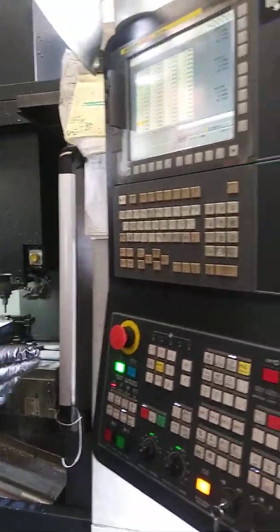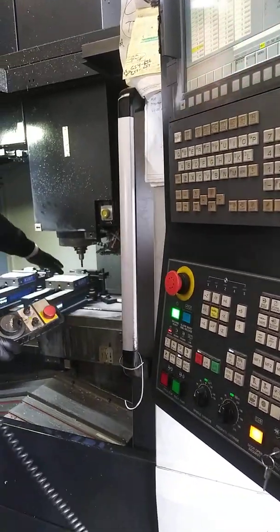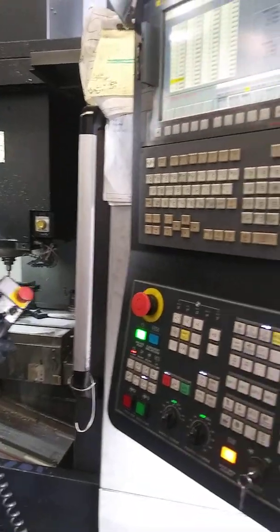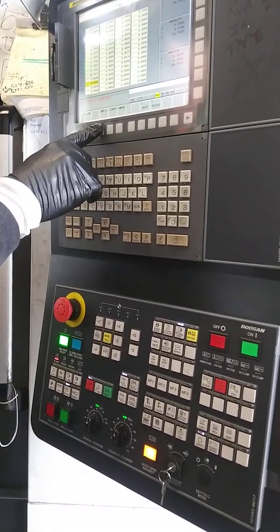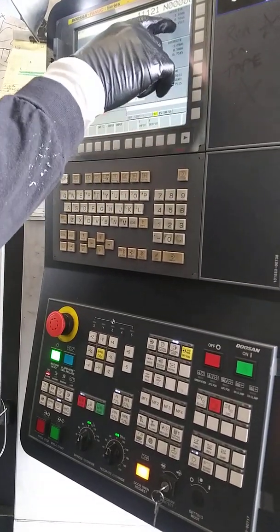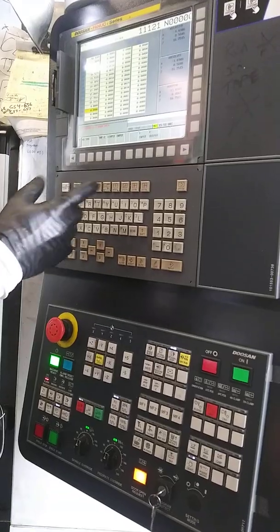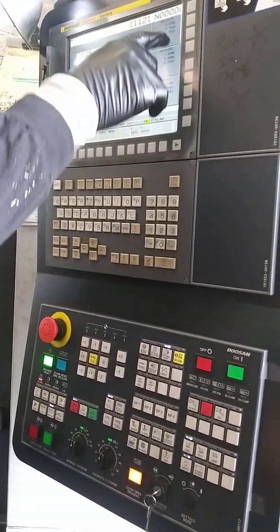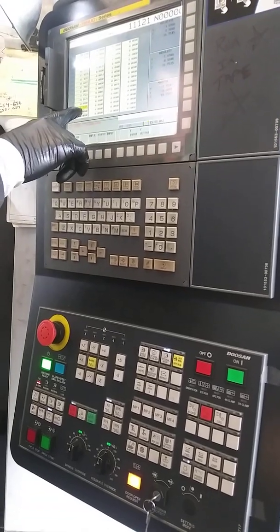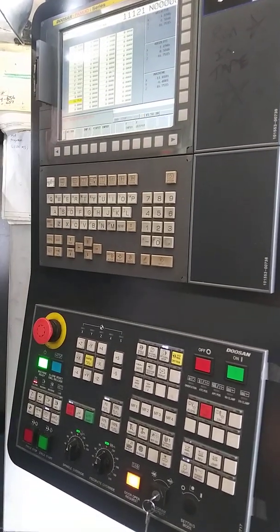Now I want to touch this tool on. This is my T10 or T9 - this is what we're going to touch off after T3 ran, which means it's a flat surface. Now I push Z, input calculate. That number, that number, that number - are all the same numbers right now. So that number is going to go right there. Input, calculate. That number - see how it matches? Boom, that's it. So now it knows that that number is over there, so now I'm good.